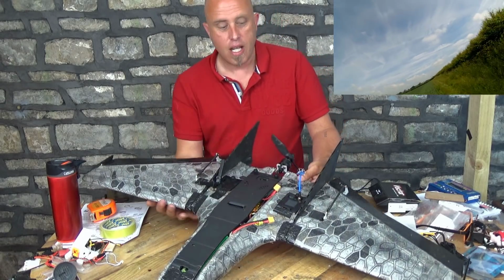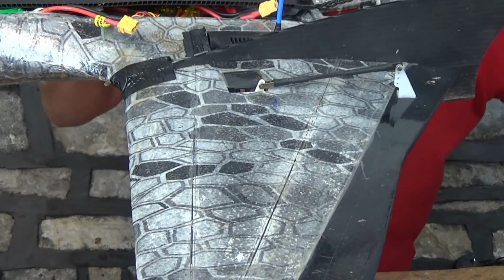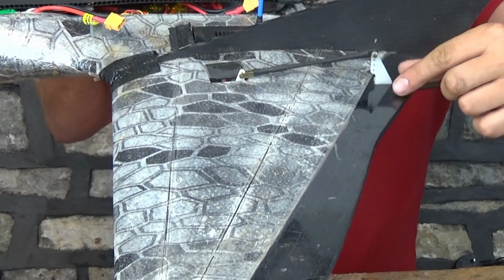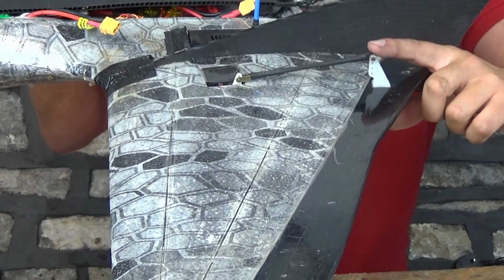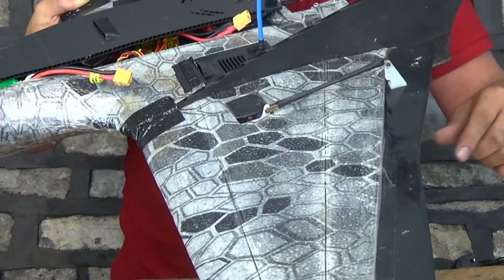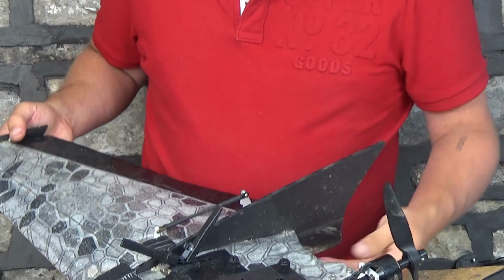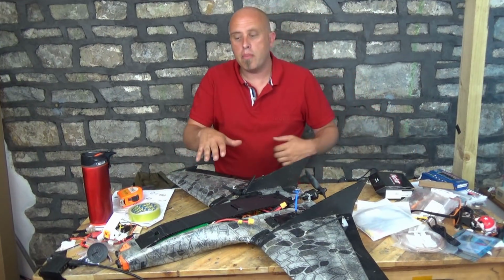just to make the point on this, because it is absolutely critical for you and the life expectancy for your model, you will notice that the servo connector is right down on the bottom hole as far as I dare on the servo, and I'm also using huge, and I mean huge, control horns, and that's very much on purpose to make sure that we get the granularity back on the stick movements. Otherwise you're having to put your ailerons down to 40 or even less than that, so do go careful of that one.